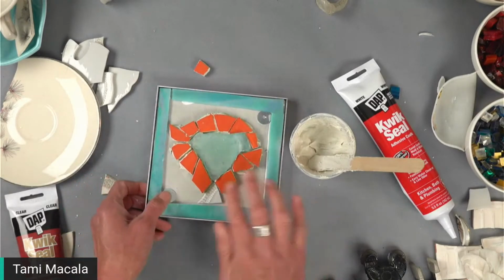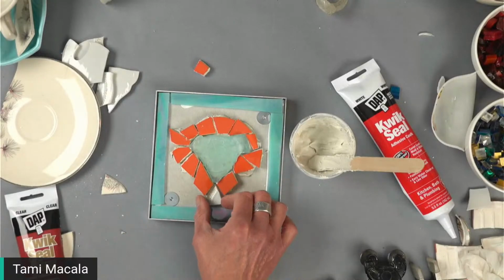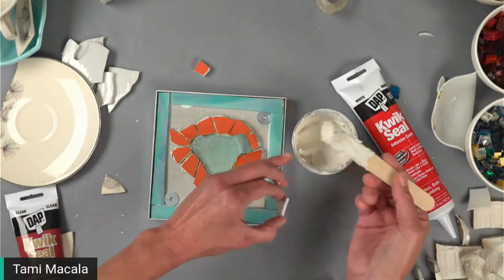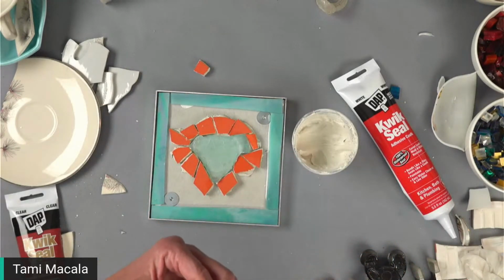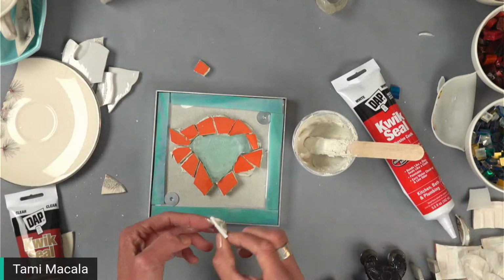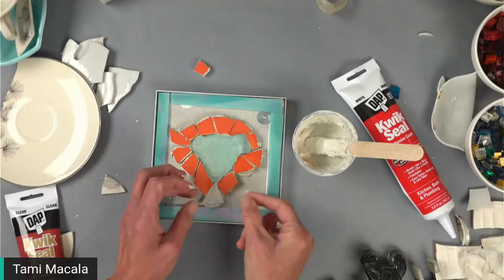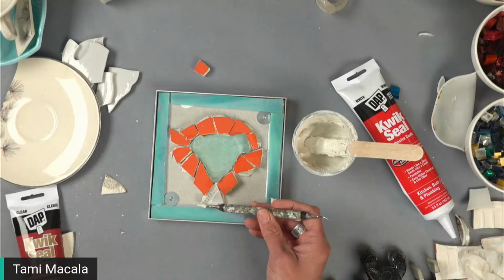I've used all 3 different levels here, and this would get buried in my grout and it's going to be a mess. So we do a thing called floating. Taking this really nice consistency of thin set, we are going to add a really good layer of it, and you're just going to drop it in there, and we're not going to push down too hard. And it didn't come up to the full level of the tile, but I'm okay with that.